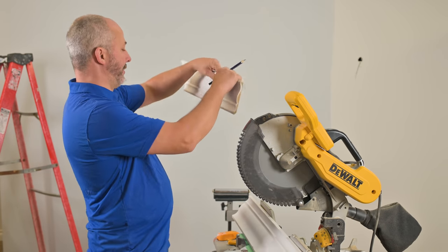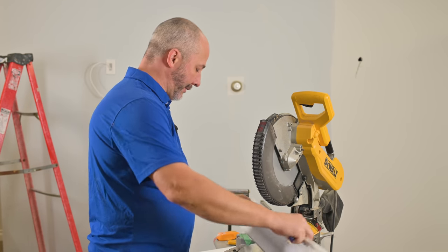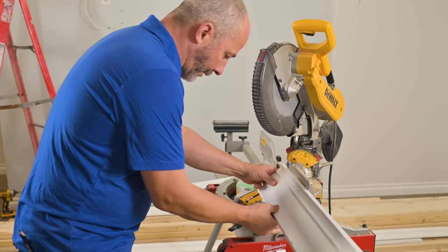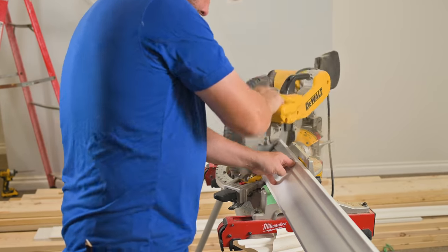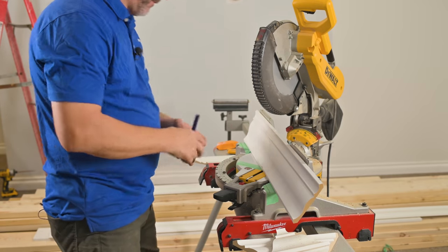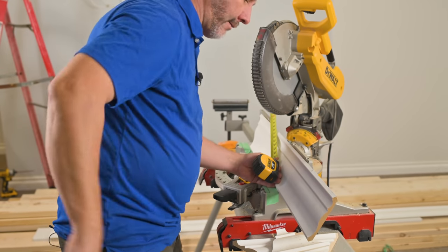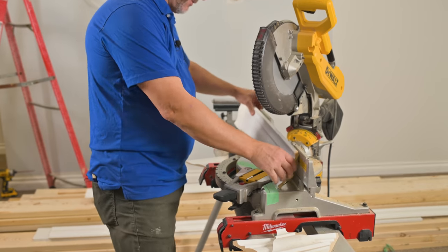Now we're going to go upside down. The next cut is 26 and a quarter and we're going to make both cuts like this. In this situation, we want to start on the left and then measure the 26 and a quarter, make a mark and cut it. This is easy. Set this edge to the pencil line, bring it over to where it'll cut. Measure 26 and a quarter — and you want to measure right to the back of the material and then make a 45-degree mark as an eyeball.